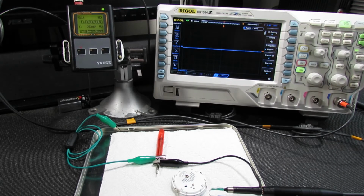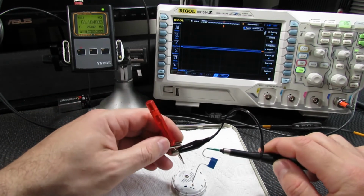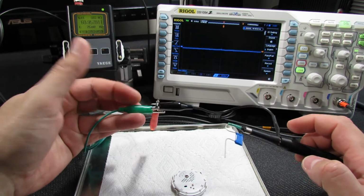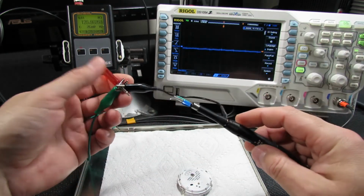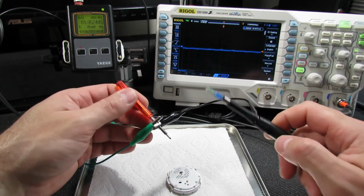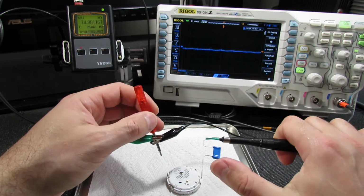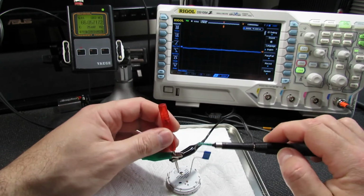Okay, now we are ready to pick up the signal and see what frequency was generated from the crystal quartz. This is my extremely horrible idea of how I can do this. A screwdriver with an alligator clip and a metal plate, a metal tray, to reduce the electromagnetic noise from outside. An additional resistor with 10 megohms resistance. Alright, let's try.